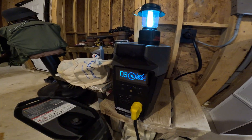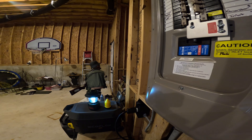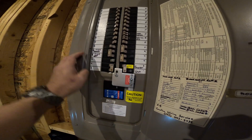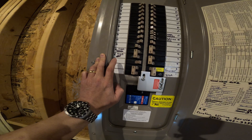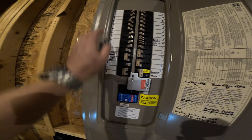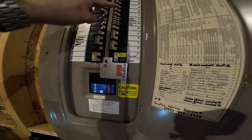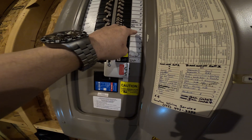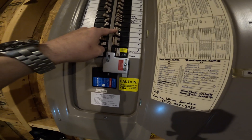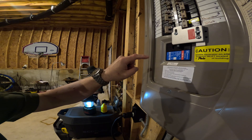Let's push this button for 3 seconds. I'm at 95% battery power. I must turn off all high load breakers. That's the range — turn off this one, the dryer connection, I'm gonna turn off 26 and 24. I'm gonna turn off garbage disposal and attic. Basement will be on. This is the range side. 11 and 9 are my condensers — I will turn those off. Downstairs — I will now turn off the main breaker.